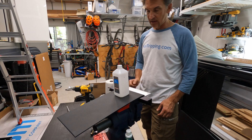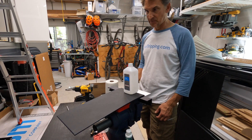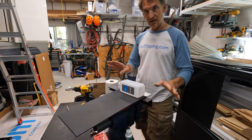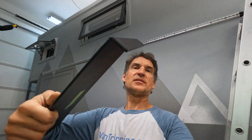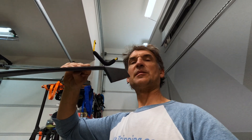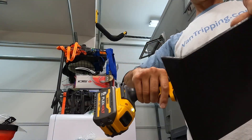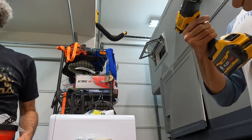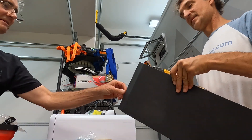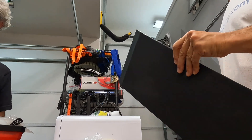I'll give it some time to cool — I'll let you know how long it ends up cooling for. You can see it's already leveling out, not springing up anymore. So the lesson here is: that angle is because I pulled it out too soon. You have to make sure you don't pull it out so soon — let it sit in there more. I pulled it out probably after five or ten minutes, but it probably needs to stay in there for at least an hour or two. Fortunately it was still warm, so I reheated it and bent it back over to get that 90 degrees. I also devised a better clamping mechanism — two aluminum angles and clamps — which worked a lot better to hold it in there.